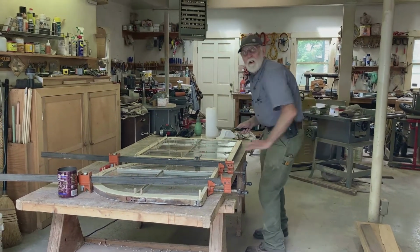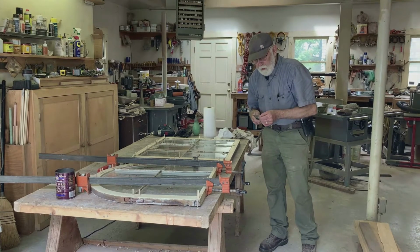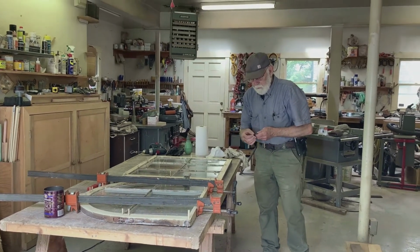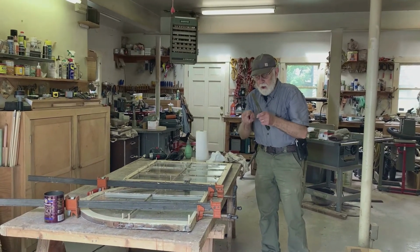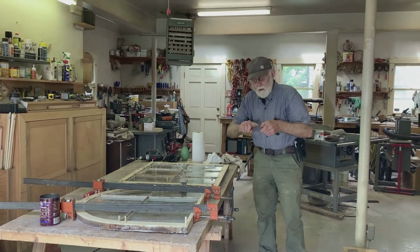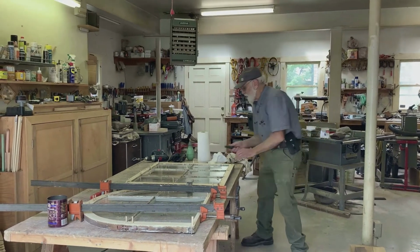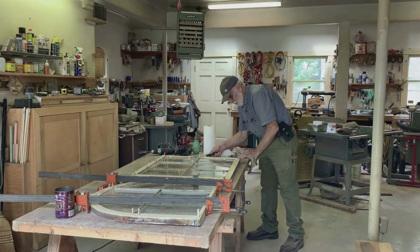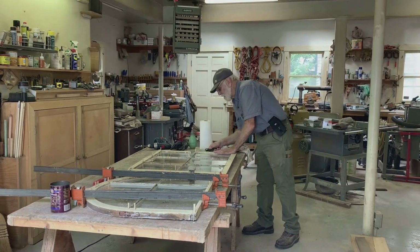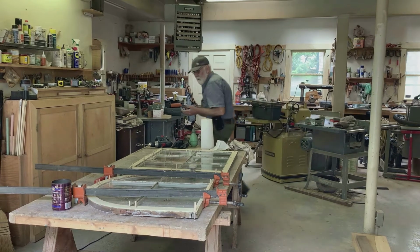So that's just a little flexible handsaw? No, it's a special saw for cutting dowels. A normal saw has a pitch, where the teeth go up in each direction. These have no pitch. So they don't scratch. So that you can cut off these flush, pretty close to flush. Then I'm going to sand them. It's a sharp little saw, but it has no pitch.